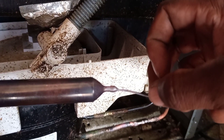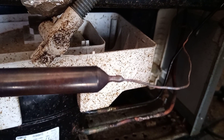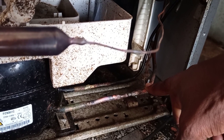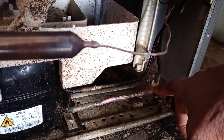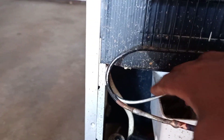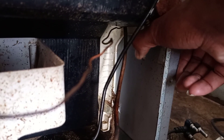What I just did on this fridge: I bypassed the inside condenser. I fitted the dryer on the outside condenser and the capillary tube. The reason I did that is because it's leaking. To figure out that it was leaking, I tested the cooling system first for a leak and it passed. After that I came to this internal condenser, fitted a Schrader valve there, and on the other side I closed and brazed it shut.